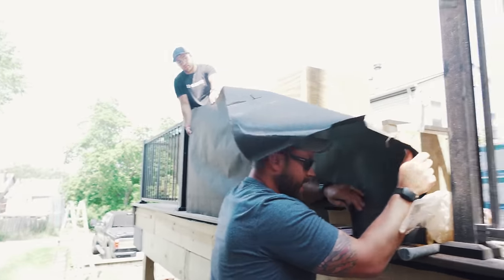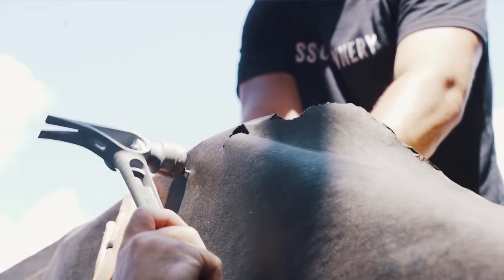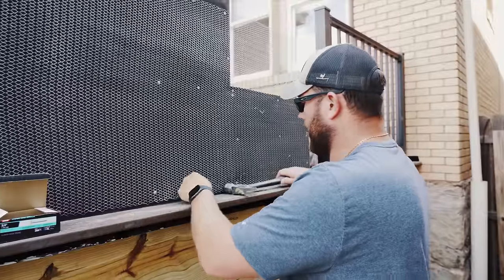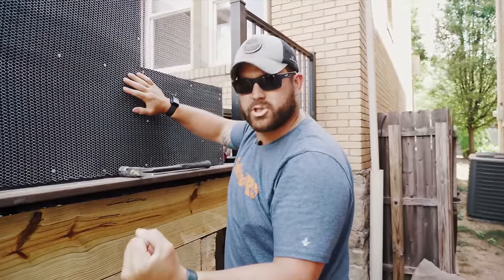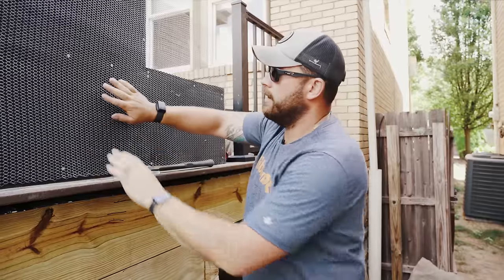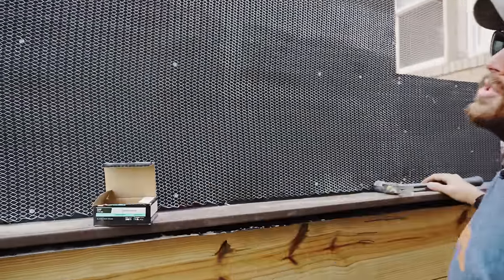Galvanized exterior roofing nails — when you sing it, they go better. We've got to put this mesh on here, also known as lath. I thought it was chicken wire, I was strongly corrected — it's not chicken wire. Maybe I just got grilled meats on my mind. But this mesh is what our scratch coat is going to stick to. We're going to mortar this scratch coat on here — pretty much doing the exact same thing Alex did, but better because I am better than Alex. And so is Sam. Jordan's getting there — he's new, he's got like 12 more minutes of work and then he'll be better than Alex. We're going to start on one side and move our way out. Make sure the nails are tight, shooting for like every 10 inches. You don't want this to have any movement behind it — you want it nice and tight to the felt paper so you have a good backing onto the stones.